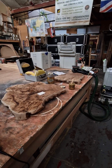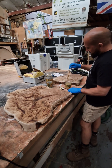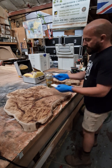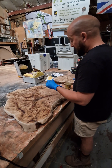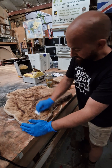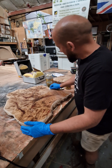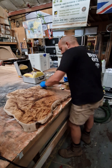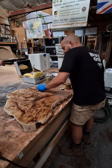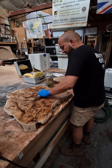I'm going to bring the camera in a bit closer so you can see what I'm actually doing. You can see the two tops and you'll see the transformation this product does. Get a little bit — this is enough to do both — get it on your scourer and then start a circular motion rubbing it in. You'll really see this oak and Vista resin start to pop. It's my favourite product because it's odourless, not harmful to the environment, food safe, pet safe, and waterproof.